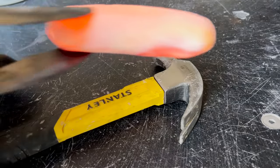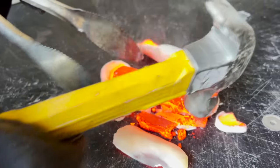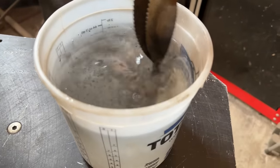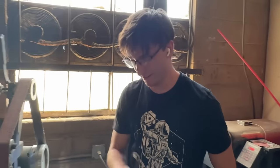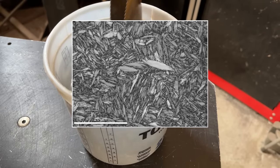So that's what I did on the test piece. It's cooling on the table. Now theoretically, this should be hardened steel. It's important to quench the steel because it doesn't give the metal time to separate back into pearlite, and instead solidifies as martensite. This makes the metal very strong but very fragile — just like a bodybuilder. Trust me, I speak from experience.